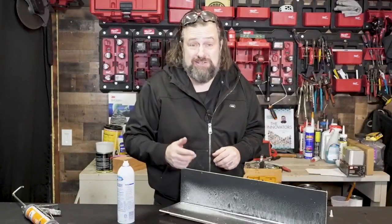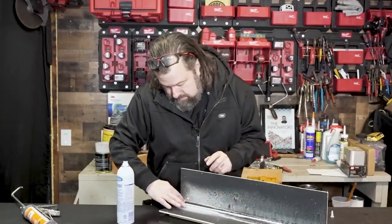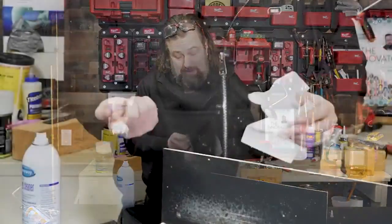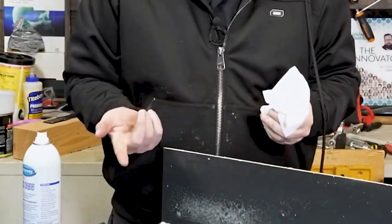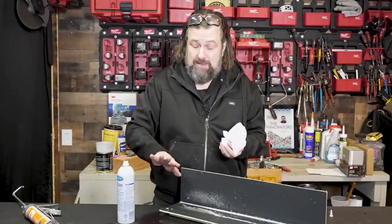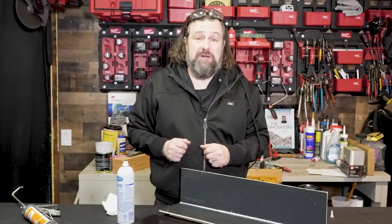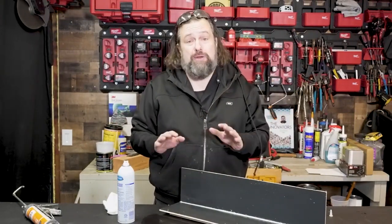When this cleans off, it's going to be like glass — so clean. Then I just come across here. There we go — I got a lot of excess right here and it comes off so easy. That is so much easier to work with than dry-smoothing silicone caulking, and I love it. That is my trick to doing silicone caulking. It's going to be so much easier than latex, and it's going to last a lot longer anywhere around water.